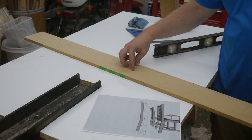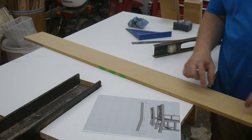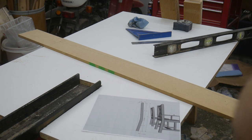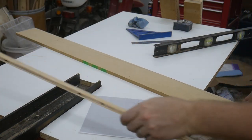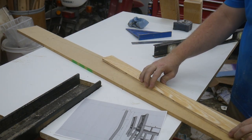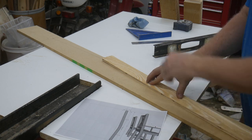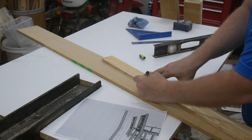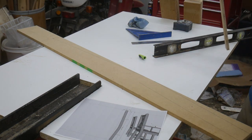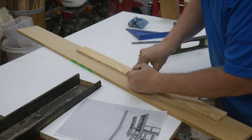I'm going to cut out a little helper — a two-inch thick strip — just so I can make these parallel lines to the front edge of this template. So I have this little strip of plywood that I cut, and I'm going to line it up with the front edge. All it's doing is giving me a parallel reference so I can trace this back parallel edge. That way I have my two-inch leg thickness that I'm shooting for here.